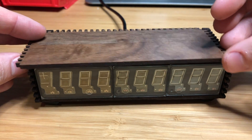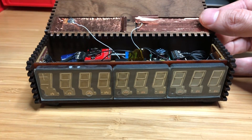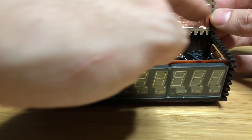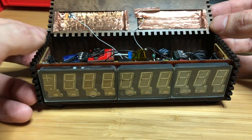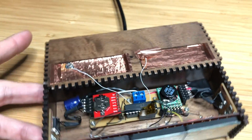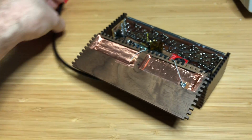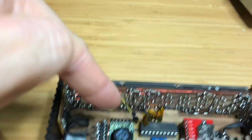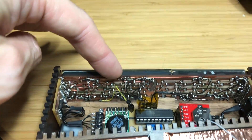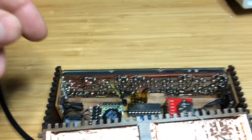I've popped off the lid and will just turn it over. Everything is press fit - no glue, no screws holding the enclosure together. You can see I'm just using some copper tape for each of the touch sensors. Peering inside, what we have is basically a four-board arrangement. We have four boards: there's the main MCU board, there's the display board, and then there are these two wing boards, which are mounted at right angles to the display board and held in place just with solder joints.